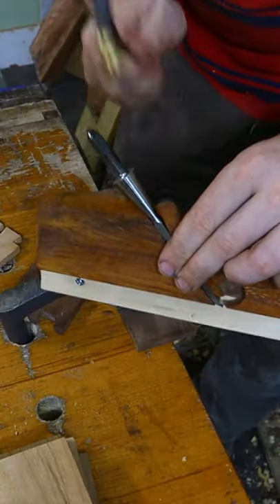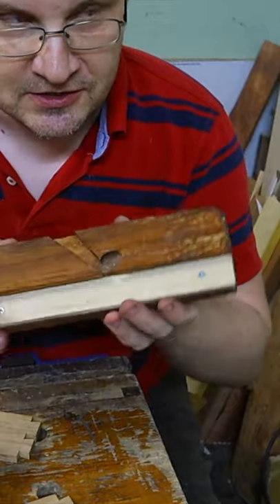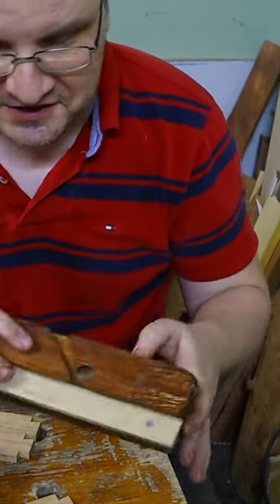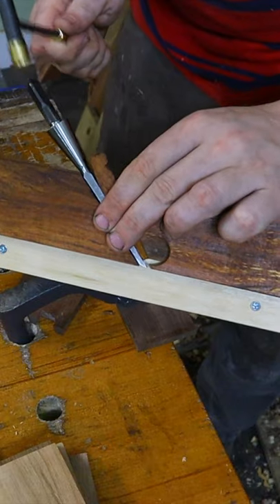You don't like noise but want to make grooves for the drawers? Look no further — you can use a grooving plane. A grooving plane has an extremely simple construction and you can make one in about 1 hour. For the blade, you can simply use a regular chisel with or without a handle, and that's it.